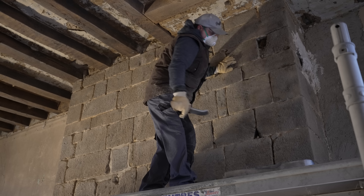You can see there's a lot of rubble on the floor at the moment because Steve is removing all of the stone and rubble between each joist. It's a good thing because it's taking weight off the main beam — there's a lot of stone and weight there. When we come to finishing off between the joists and the main beam we'll have space to do some plastering or plasterboarding. We've got to do that before we can do the floor as the falling stone would damage it.